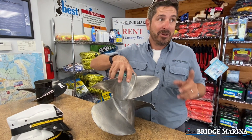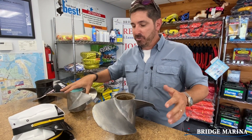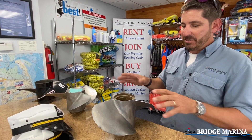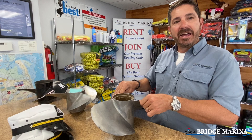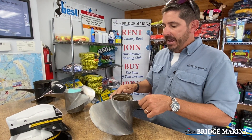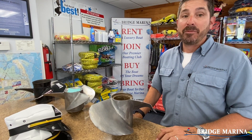These need to be repaired. I know this customer is actually still driving the boat and was surprised it had an issue. But there's so much prop here that it's able to move through the water — it's just causing a lot of vibration on that prop shaft, which could damage the prop shaft. And it completely damages performance.